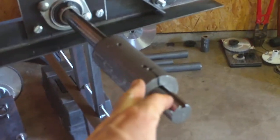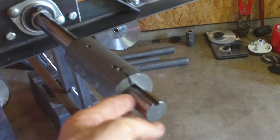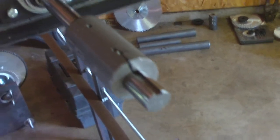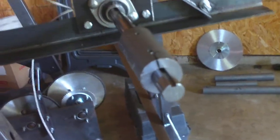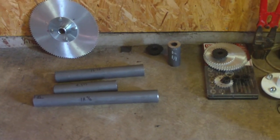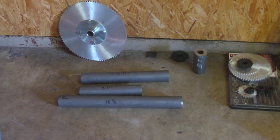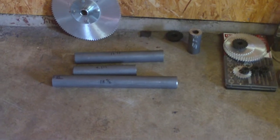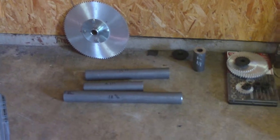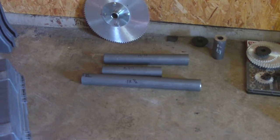So for the sake of avoiding crazy costs, we're going to give this a shot. The whole idea is that by increasing the diameter of this transfer shaft to two inches, the deflection will get down to an acceptable range. I have one piece done and four pieces to do — it's a lot of work. I could sure use a lathe; a carbide cutter on a lathe would have this done in a fraction of the time. Hopefully in the next week or two I'll have all these pieces honed out, get them on there, and we'll see what kind of deflection we have.